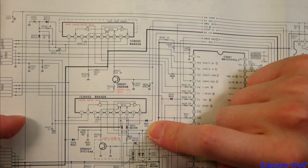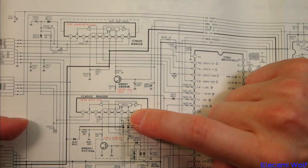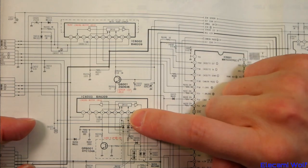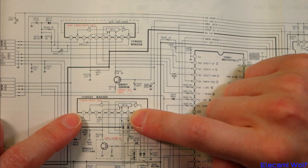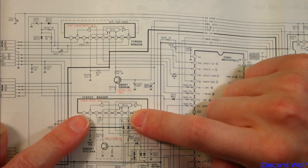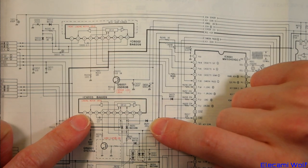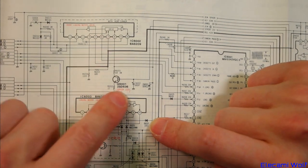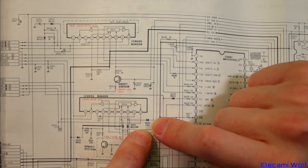There's an enable circuit for that, and then it carries on down here, goes through a diode, then it also goes into the same pin of another motor driver — and that's the loading motor. That would be the one that powers up briefly. So I'd suspect that one's a problem. What we could do is desolder that diode temporarily, put another fuse in, and see if it blows — and that way we'd have discounted this part of the circuit. So I think we'll try that.